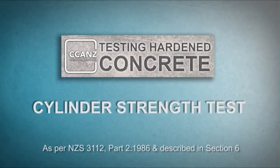In this video, we're going to determine the compressive strength of a moulded concrete cylinder. This is commonly called a strength test. The relevant standard is NZS 3112, Part 2, and determining the compressive strength of a moulded concrete cylinder is described in Section 6. You should note that the standard specifies in detail in Section 3 how cylinders should be prepared and stored during the curing period.